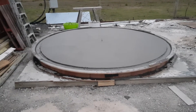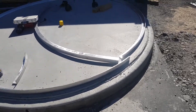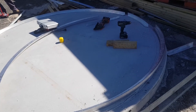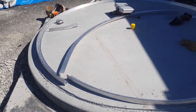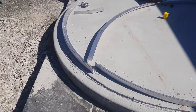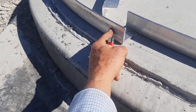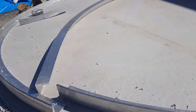The concrete will cure nice and slowly tonight. We're now fixing the aluminium angle — we've just cut to length the aluminium angle you can see down there. That's a 50 by 50 by 5mm thick aluminium angle that we've had rolled to the radius so it sits 100mm in from the edge of the slab. Once this is fixed down onto the slab edge, we'll pull over the airformer and fix strapping over it to keep it locked in. We're going to do a test inflation this afternoon.